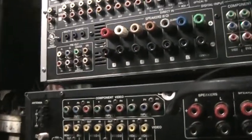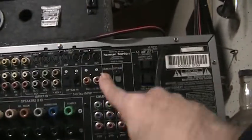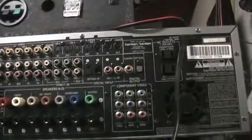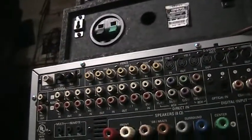Now we've got a better view. An easy stack would be to find receivers that have SP/DIF in and out and then feed them. This Harman Kardon — as long as you're doing DTS — will spit out optical and coax at the same time. So feed one sub-receiver coax and the other optical. Since they're on DTS, it carries its own timing signals.